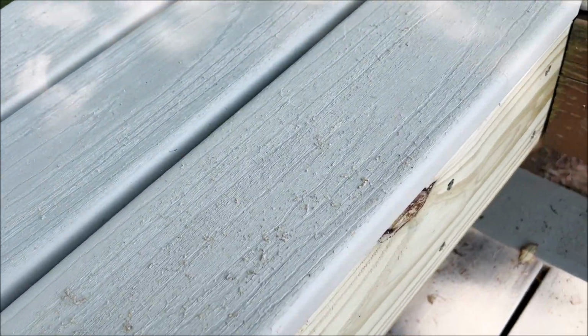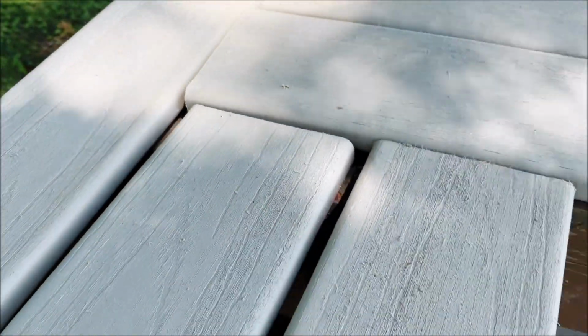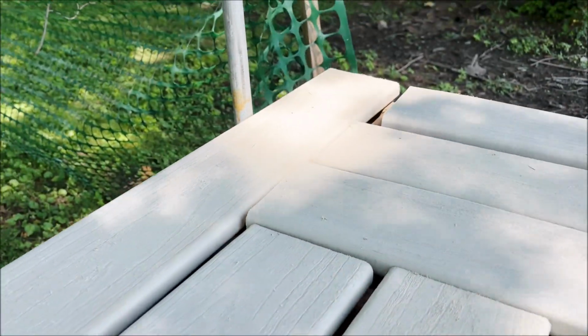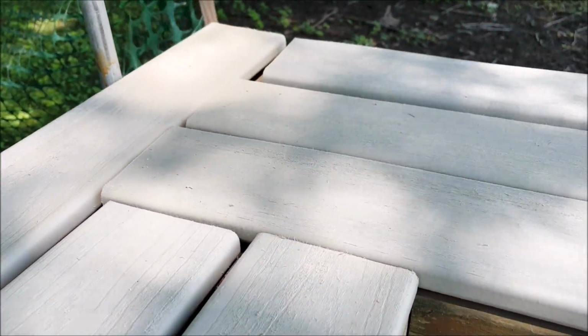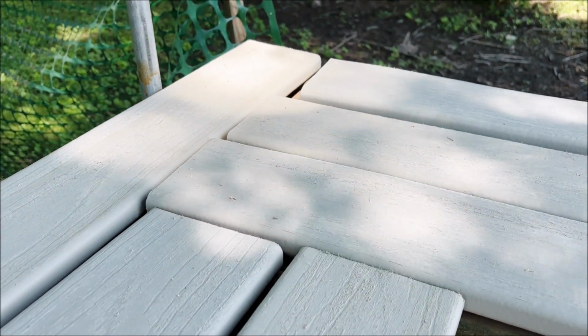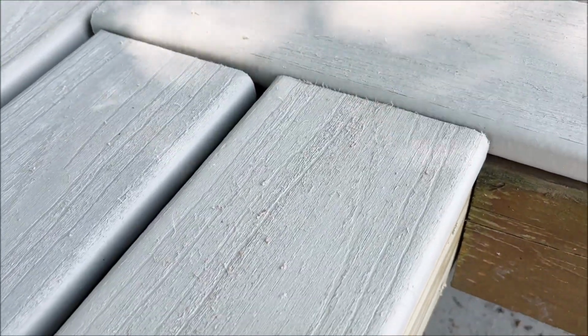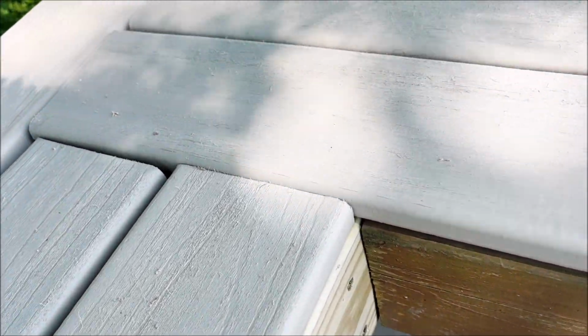Trouble is, this is not square, so you can see up there that there's a gap. So once I do that inboard, I'm going to have to cut about 2 degrees, a little over 2 degrees off the end. I've done that here, so you can see that that is sitting flush up against that board.